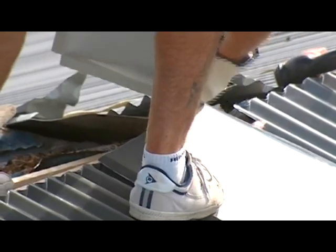Cut the sheets with automatic shears or tin snips if a roof penetration or other obstacle is encountered. Never use a metal grinding wheel to cut. It leaves burrs and damages the sheets, and the hot swarf will burn into the coating.